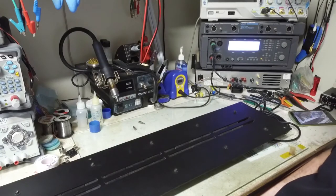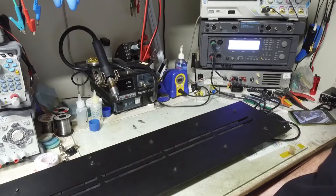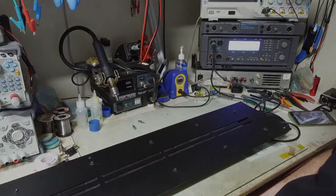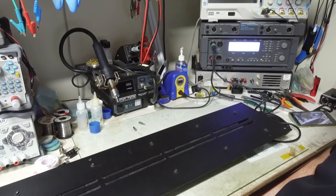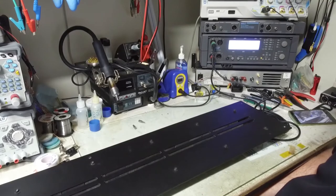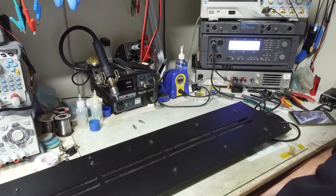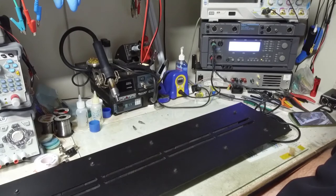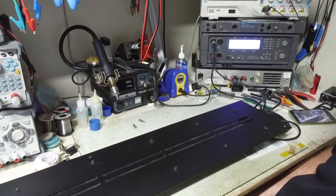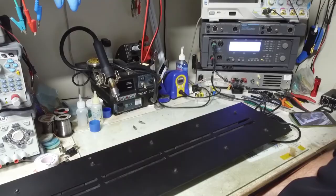I've got the planar driver hooked up to my audio precision audio analyzer and I'm running a frequency sweep over the whole audio band. One of the glories of this type of driver is that the impedance is flat — it's almost a pure DC resistance of approximately 6 ohms. It does not vary at all, or I should say it varies just a very tiny bit at a couple of points. The crossover characteristics do not change according to frequency, which is why I typically use a very simple crossover.